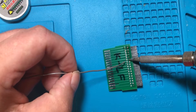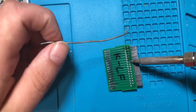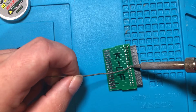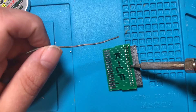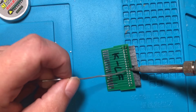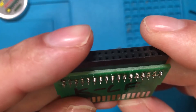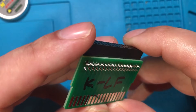It wants to sit on top of the solder joint instead of soaking in, and we're at a blazing hot 420°C — so it's not the iron temperature causing that. We're getting little peaks on top of these things — not the best experience. Lead-free solder is harder to work with in general, and I'm probably not even going to finish soldering the board with this. We're getting chunks of solder on top — it's just too thick, not the right product for this application.